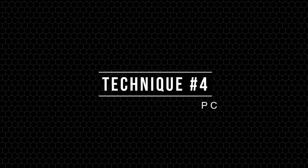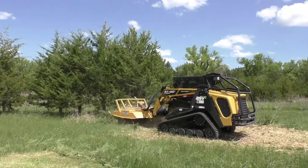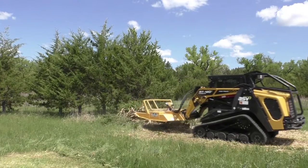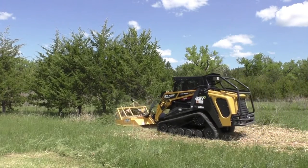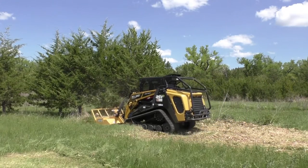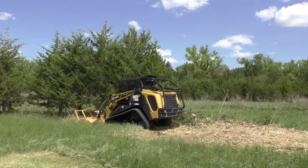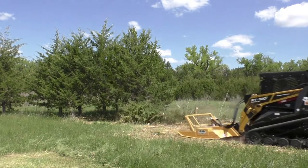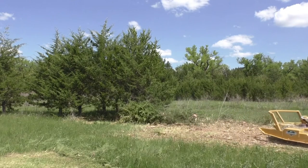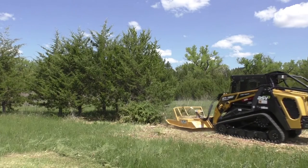For users that want tree stumps at or below ground level, you'll want to use the stump cut technique. First, drive over the stump with the skid shoes level to the ground — you'll be left with a stump about 3 inches tall. Then back up off the stump, lift the back of the head up and point the nose down so that the blades are skimming the ground. When your blades are up to full speed, drive forward over the stump with a quick but smooth motion. If you don't make it all the way through, back up, allow your blades to recover to full speed, and repeat.